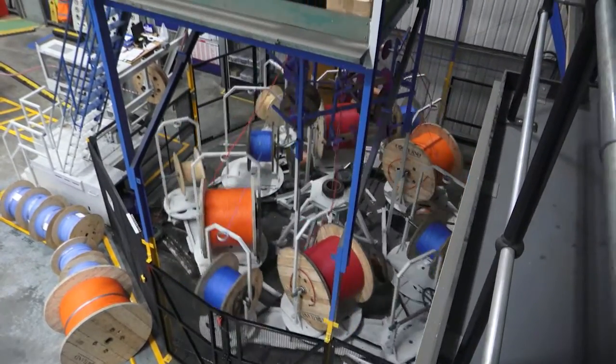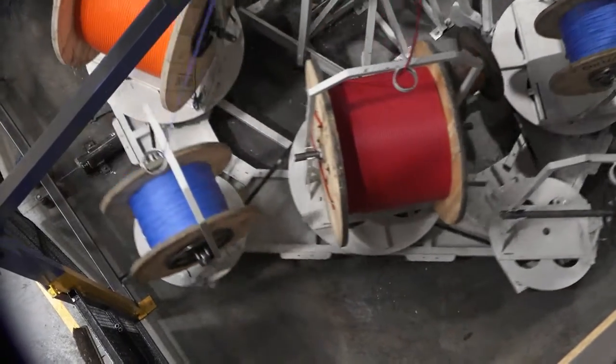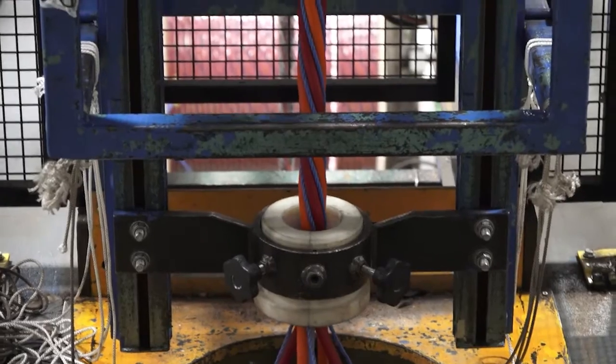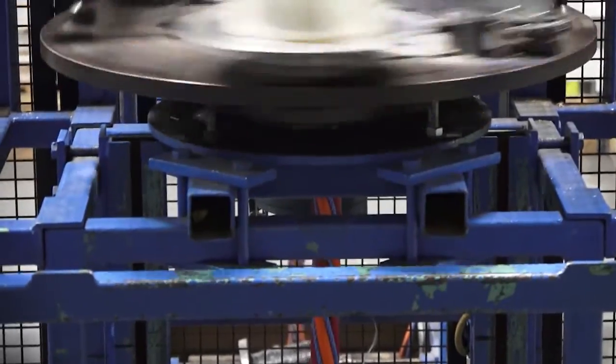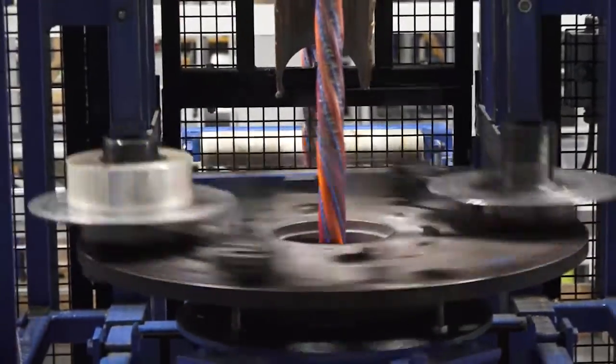Our umbilical cable is being manufactured in the UK. The core of this cable is five electrical conductors for power and five fibre optic cables for data. They've got a machine that feeds in the raw materials, combines the electrical cable stock and the fibre optic tube. Then this core is covered in a polyethylene jacket.